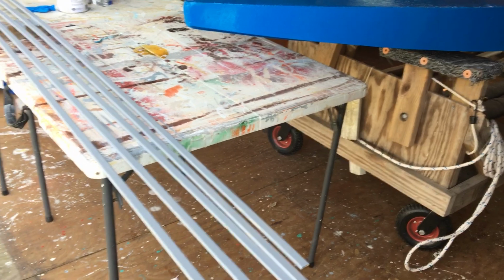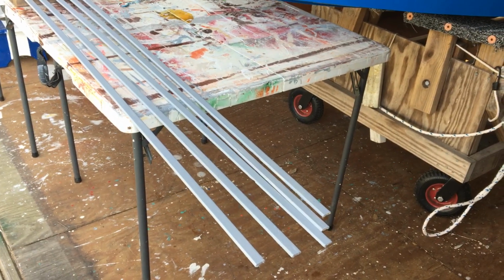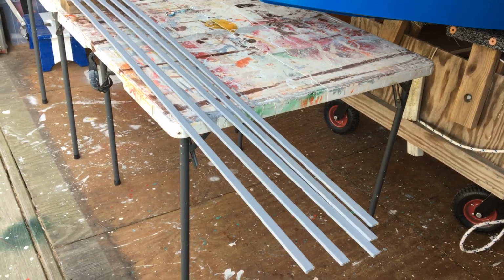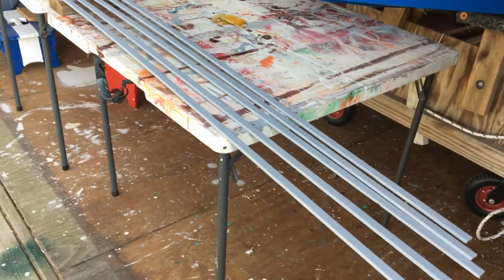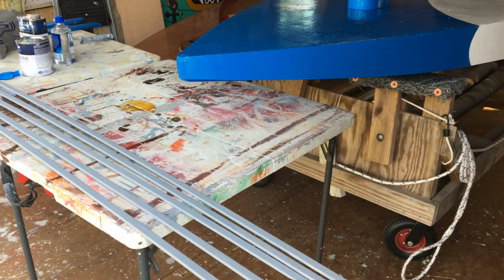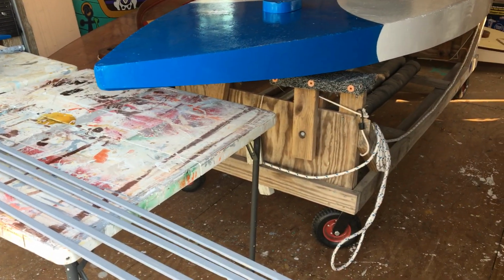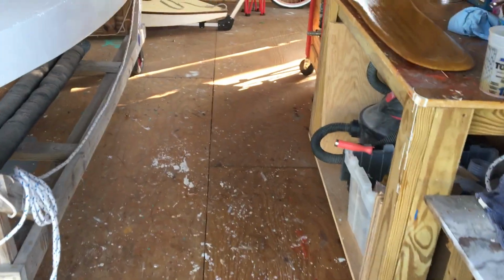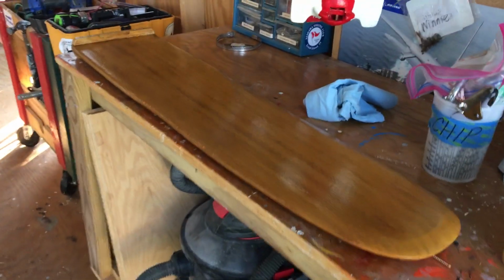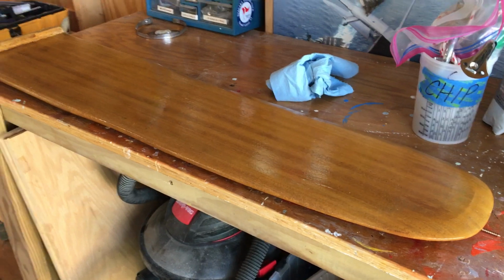Doobie, our buddy at Lowe's, gave us a little tip. There are different pre-cut trims up there, and this is solid wood. So it's one piece of wood all the way from one end to the other. There are some other trims out there that are finger jointed, so you get little short pieces of wood and they stick them together. And he said the glue in that is not waterproof glue, so you have to watch it and make sure it doesn't just start splitting apart on you.